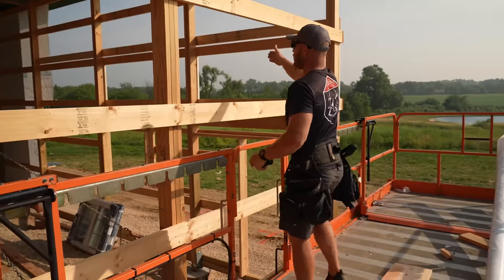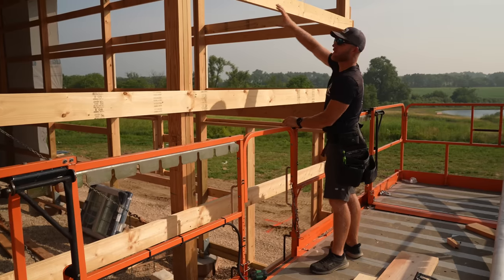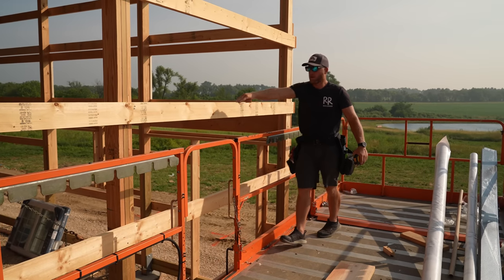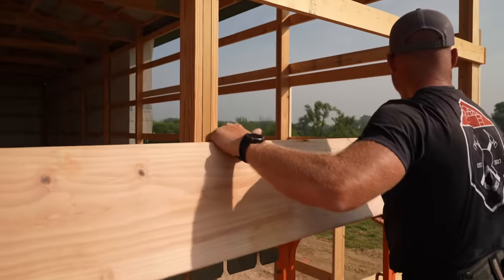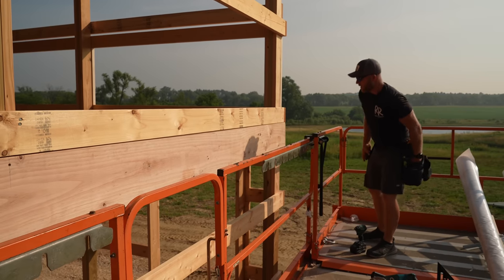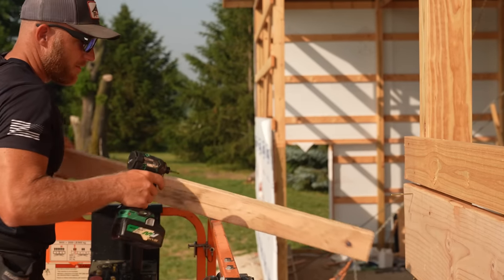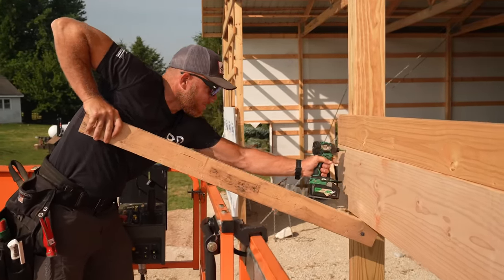Here in the front, this porch goes down the sidewall but then it gables out of this wall, so we're gonna have to do some framing down here. That board we put up there for our connection trims — where the roof dies into the wall — we don't have that here; we've just got to do a gable frame. So it's gonna come around this corner and then come back down to about right in here somewhere. I have to use the power of leverage since I'm by myself.